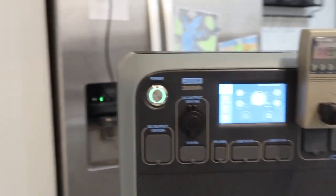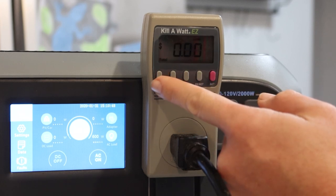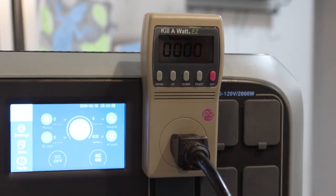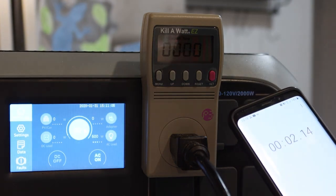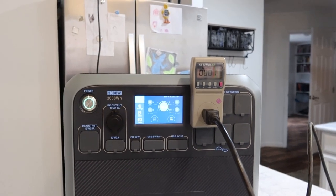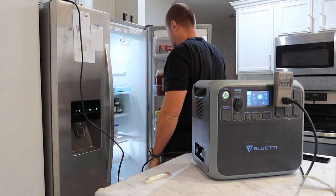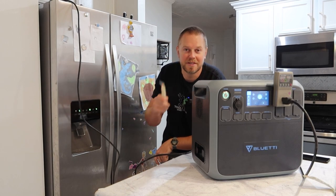Good, we've got a display on the meter. Let me do a reset on everything. Let's click the menu — we've got zero kilowatt hours used. Currently it's showing 600 watts. Let me go ahead and start the stopwatch to track the overall time. Up close it's showing 588 watts on the fridge. I may open the fridge a time or two to get things a little warmer in there, and then just let this test run normally to see how long it will run the fridge off-grid. How about I grab a cheese stick — just a cheese stick. I'll bring you back in about an hour.